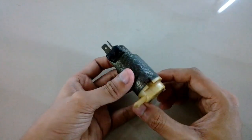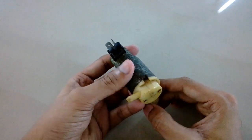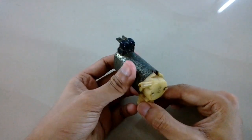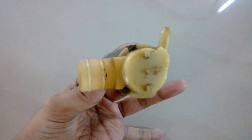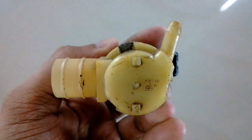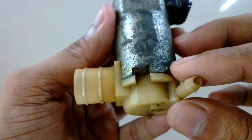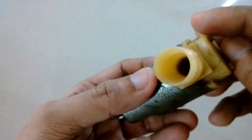It's a very powerful pump — it pumps the solution from the tank to the spray nozzles located just below the windshield, sprays it on the windshield, and the wiper then cleans it. Every vehicle has this sort of pump. Nowadays they look a little different, but back then it used to look like this.